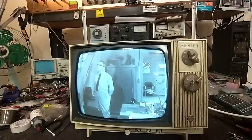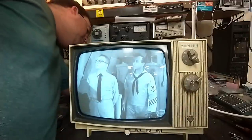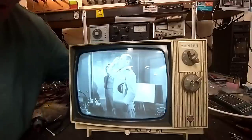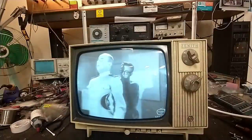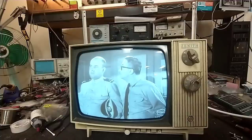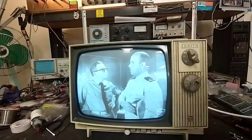This thing's looking good. Amazing the difference giving it a little love tap with the Beltron made. I think the vertical is a little bit stretched - we're going to back off on that some. That's got a really nice picture on it. Somebody just played it to death until the CRT was exhausted and then shoved it in the closet. Hopefully the rejuve will last - usually they do with Zenith tubes. This is a really easy fix. Hope you guys enjoyed this little snippet and more stuff to come.